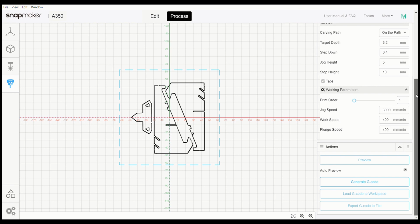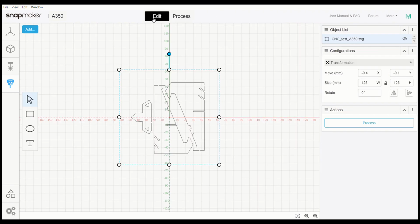Now, I'm going to back up here real quick just because I noticed something. I know you guys are reading through your setup manual that came with the Snapmaker or not, but if you read on initial setup, the next page over is fix the material 5.2.1. It says the size of our provided model is 139.2 by 141.5 millimeters. Make sure the clamp set does not impede the movement of the CNC bit. So why it's saying this over here for the 125 by 125, I'm not exactly sure, but for entertainment's sake and not crashing the machine, we're just going to go with what the software is saying for right now and leave it at that.